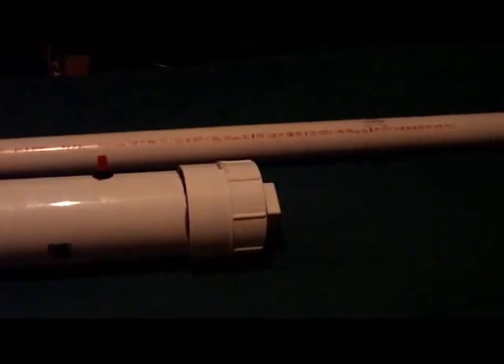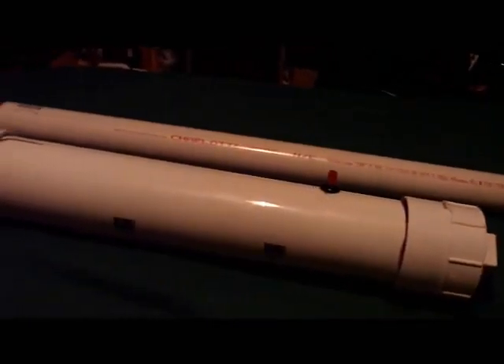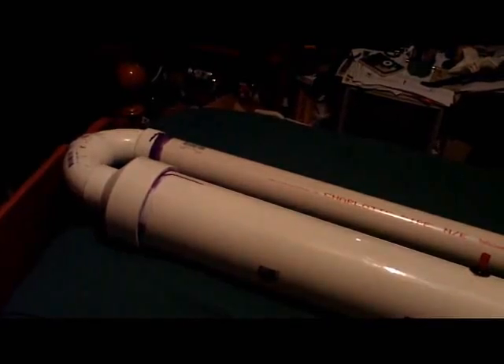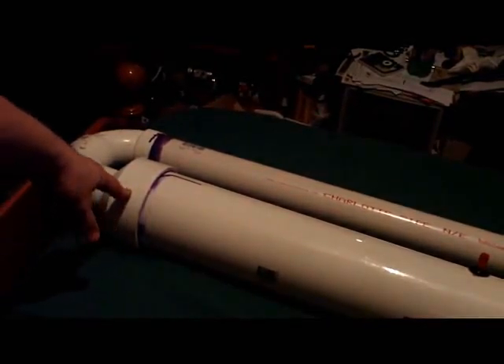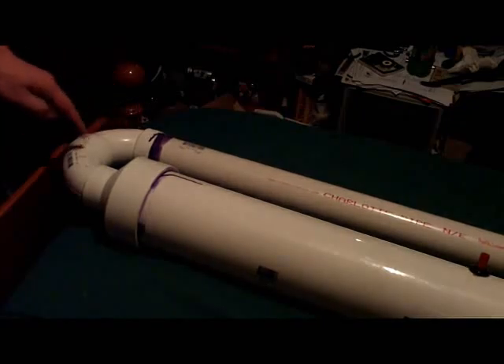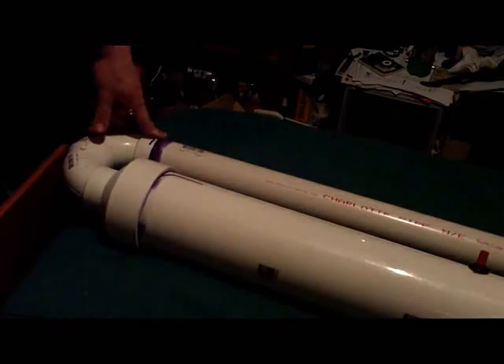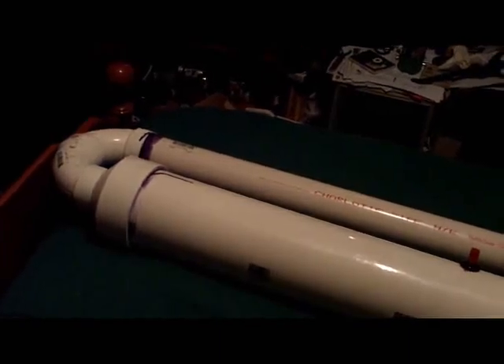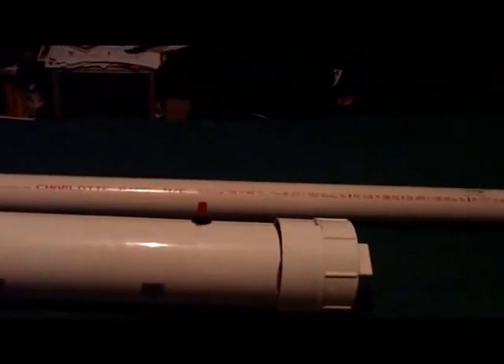Then I've got a 2-foot section of 4-inch wide PVC pipe, that goes to a 4-inch to 2-inch reducer — that's this part — makes it go from 4-inch pipe to 2-inch pipe. After that, I've got two 90-degree 2-inch street bends, where it has a male and a female on. After that, I've got a 5-foot long section of 2-inch PVC pipe. This is all schedule 40 PVC pipe with a 280 PSI maximum limit.